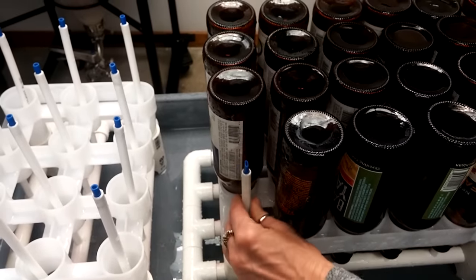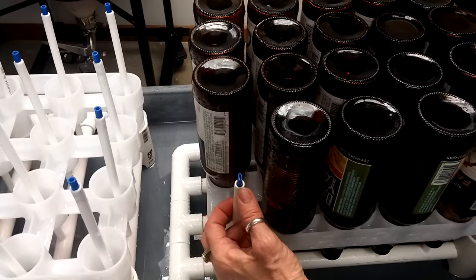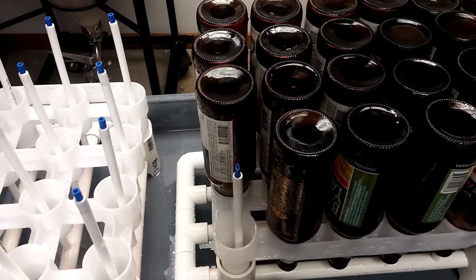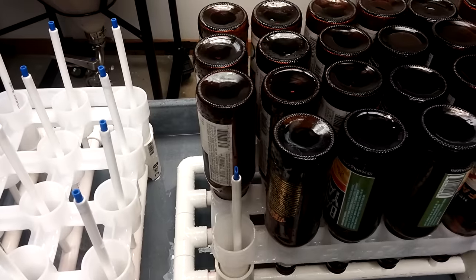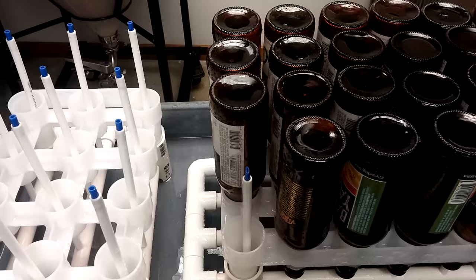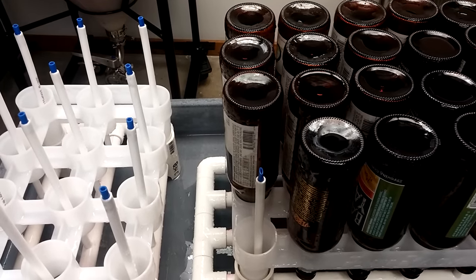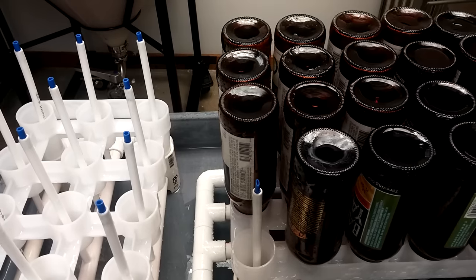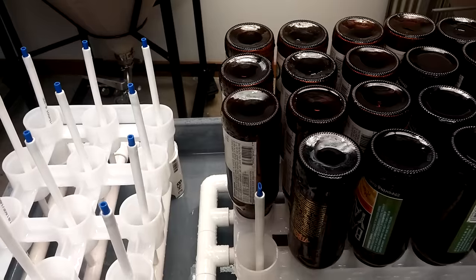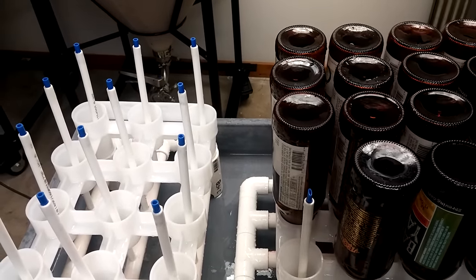The blue tips are quarter-inch pneumatic tube. I snipped off a bunch of pneumatic tube. It doesn't fit into the PEX, so you have to use heat — I used the outside edge of an acetylene torch, warmed them up, and then put the tips in. When they cool, the PEX shrinks around that pneumatic tube and they do not move. They're in there forever. I just snipped them off in a saw so they're all the same length.